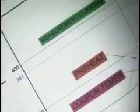There are also electronic measurement systems that can verify all of the setup parameters for the entire wave soldering operation. They pass through the system in the same manner as the thermal-coupled assemblies we discussed earlier. In addition to verifying parameters, these instrumentation systems print out statistical process control charts that indicate variations in the process. These devices should be used after all systems are set up.